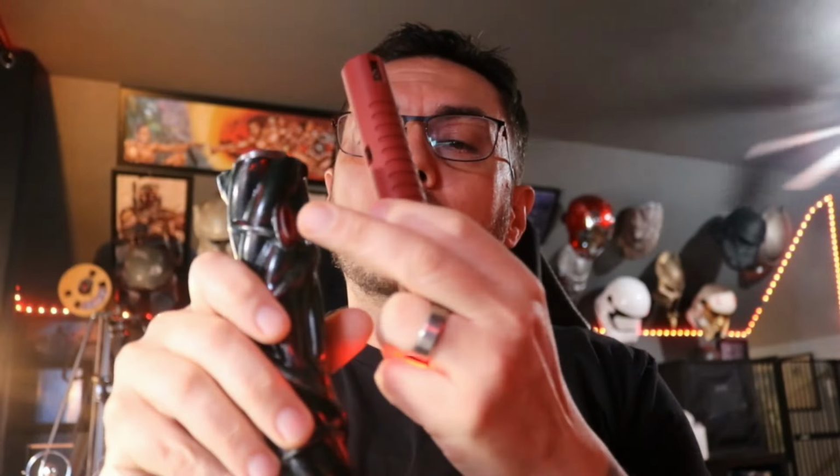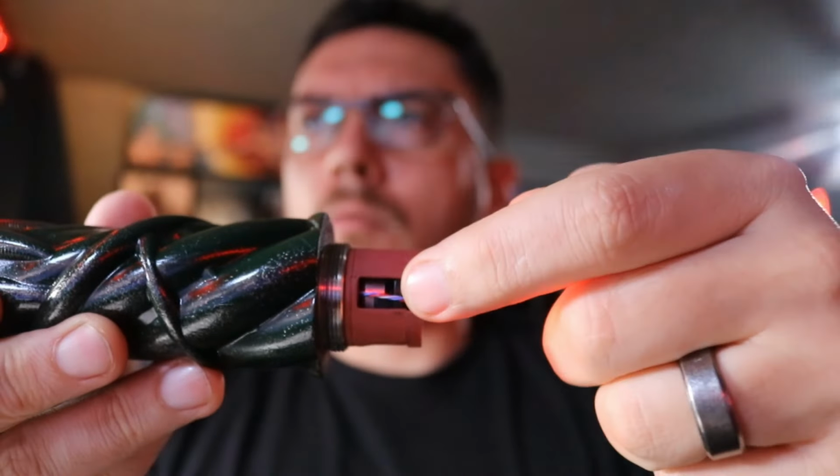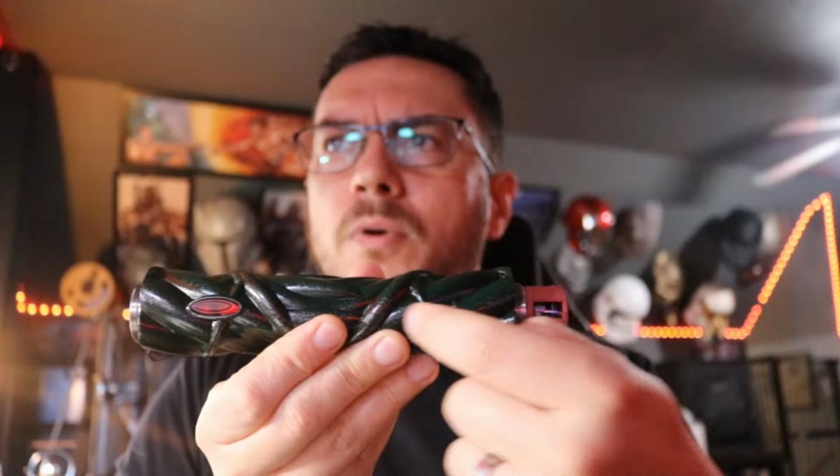All right, so we're gonna take this and turn it back on. Take your switch and line it up with your plunger switch here, but I'll show you another way to line that up. Right when you get to the point where you're gonna have to press fit it in, you're gonna get about that far. We haven't reached that line yet. But again, you're going to want to make sure that cutout is in perfect alignment with that switch. So you just look at it like this and kind of eye it, and then push it in. Push it into that line. I'm going to show you that here in a second. Let me get it perfect.